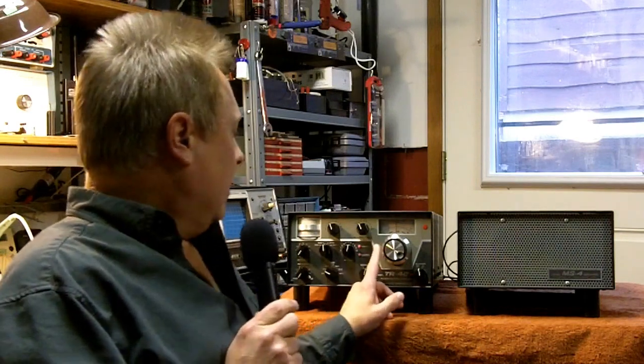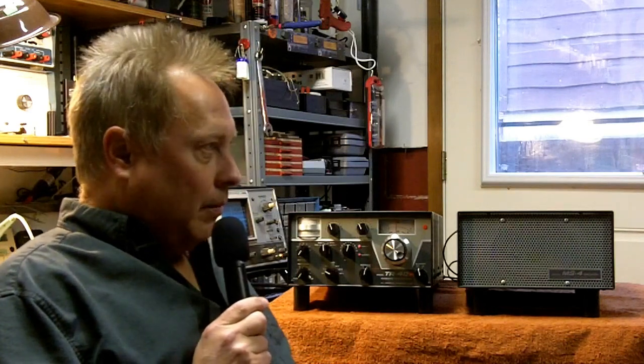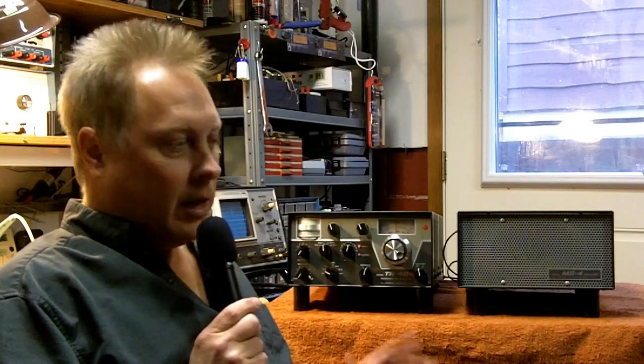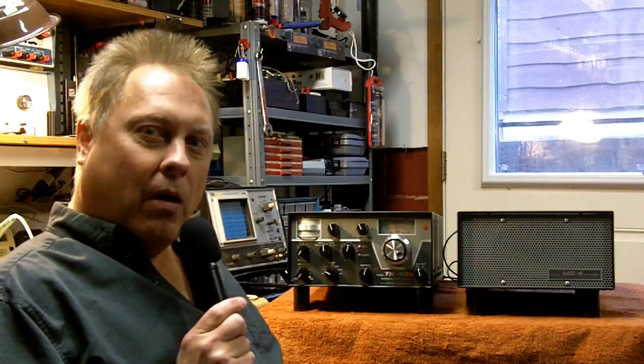The Drake sold for a little bit less money. I purchased this for approximately $600, brand new, from Electronic Center in Minneapolis, Minnesota, in 1976. Since I haven't had it powered up in several years — well over 10 years, I would say — it's just been sitting. I've been using my other radios, and as time went on I was kind of afraid to power it up, fearing possibly one of the electrolytic capacitors might have dried up or weakened. I hate just powering it up and blowing something out, so I thought I'd bring it down on the bench and power it up slowly.